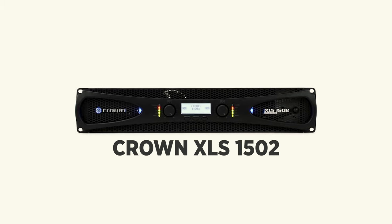And then from there, we go down to a Crown XLS 1502, which is a fan favorite amplifier at a good price point. I think of it as an everyman's amplifier that you see all over the place. Again, Class D, very transparent, and it gave us plenty of juice to power all of these speakers equally. Exactly. And we kept it at the same volume to see if there was any difference in volume, which there was. Oh, a lot. There was a huge difference in volume, and that just goes to show how the sensitivity of a speaker affects it.